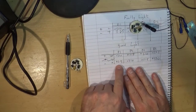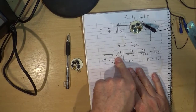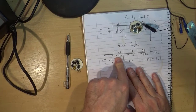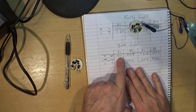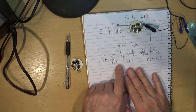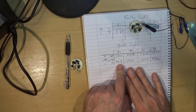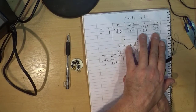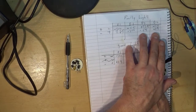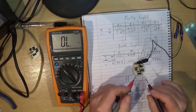So I've done the good unit measurements, and we either have 11.5 volts across a diode or 310 to 330 millivolts. That's a forward-biased Schottky diode, and the 11.5V is a reverse-biased diode with most of the supply across it — which is what we'd expect in a bridge rectifier. These 5.9 volts here would indicate that one of the diodes is faulty.